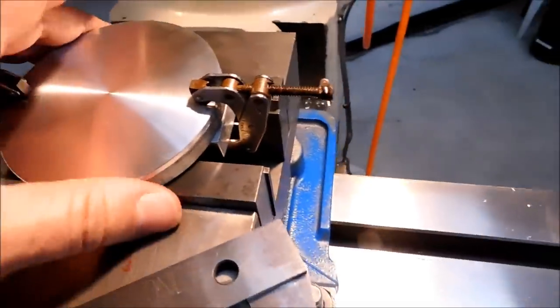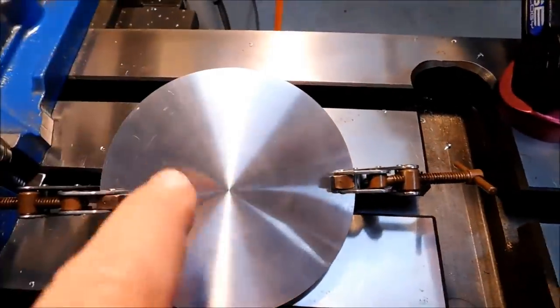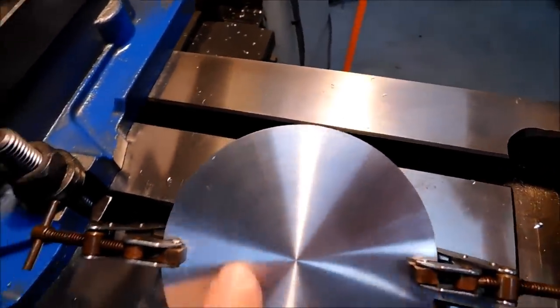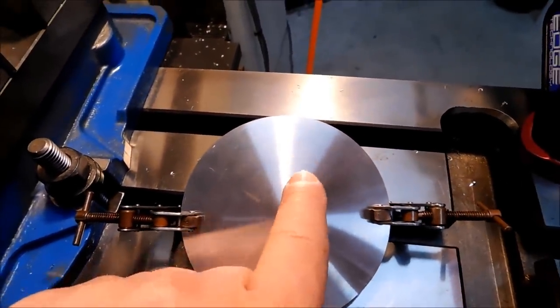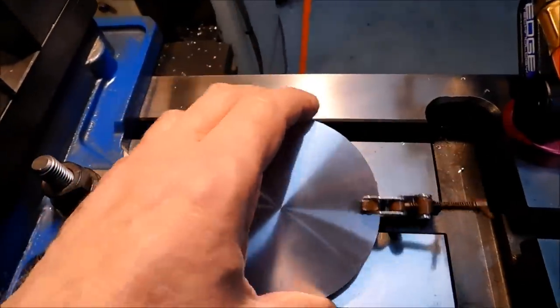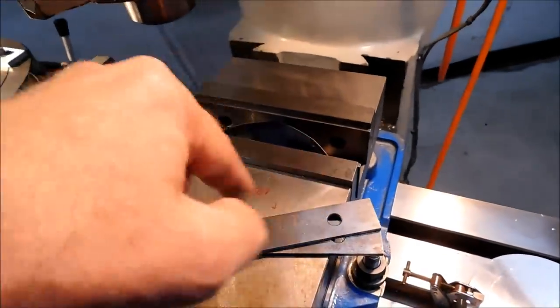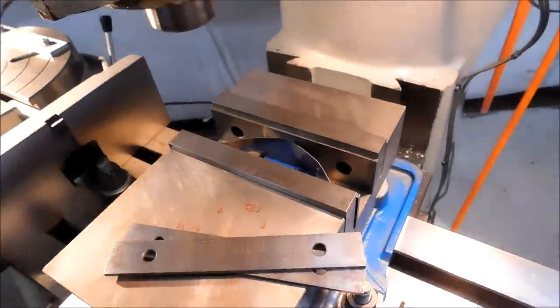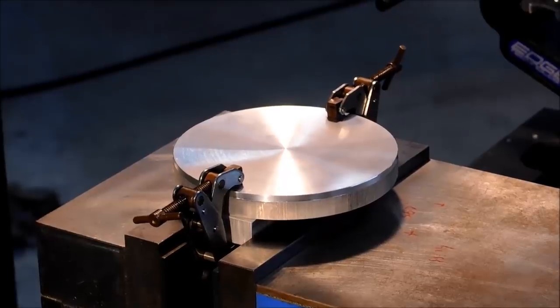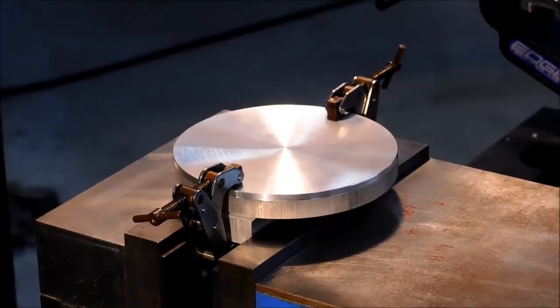And since I have a CAD system in my office, I went in and laid out a 14-hole pattern, so I now have the coordinates to drill 14 holes in this at the 25.7 degrees that I had on the screen inside. So that's the next step. Set this up in here, tram it, drill 14 holes. Let's get it done. Okay, through the magic of accelerated video, I'm going to pop a .251 diameter hole in the center of this and 14 equally spaced holes on a 2-inch bolt circle.